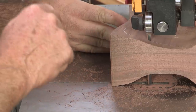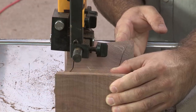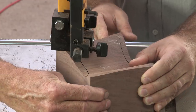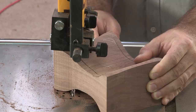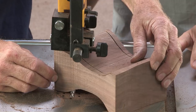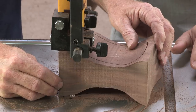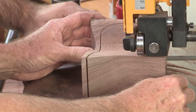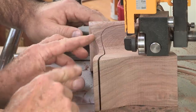This is going to be a tight curve, so you're going to have to start making that bend now — swing it, and slowly swing it tighter. Let me step in a second. Watch what I do — this is my pivot hand. I'm really going to put some side torque on that blade. You think, boy, I don't want to do that — but see how it just walks right around the bend? You can force that. That's how I want you to finish your cut on this side.